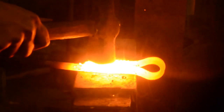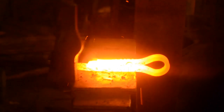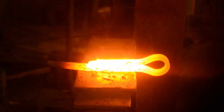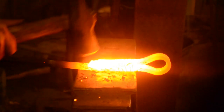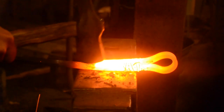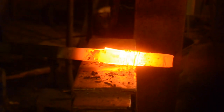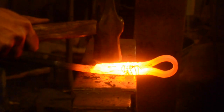You want to heat up the billet until all three layers are the same color. Through the welding lenses they should look like butter in a microwave. Unfortunately the camera doesn't pick this up. You need to watch it carefully — the difference between welding temperature and burning temperature is very little. Once it's heated appropriately you need to move fast; you've only got a few seconds of welding temperature. You need to hit it in a very specific way — the blows need to be soft but firm at the same time. You want to get all of the blunt part of the impact but none of the sharp part, otherwise you can jar the pieces apart. If you have to work the seam on its edge you want to be very, very gentle — it's really easy to rupture the weld like that.